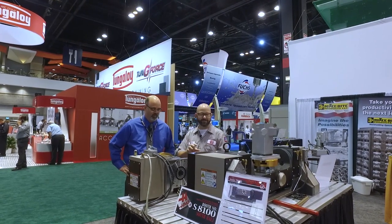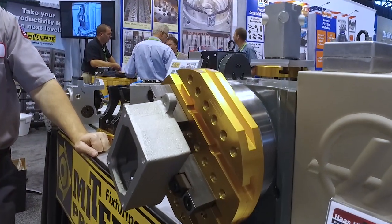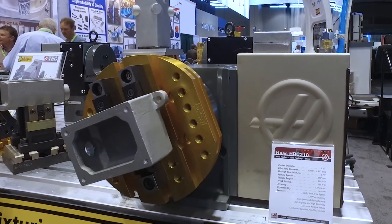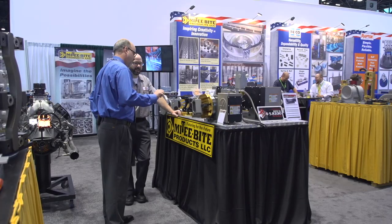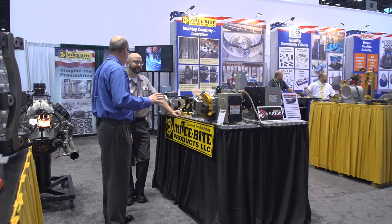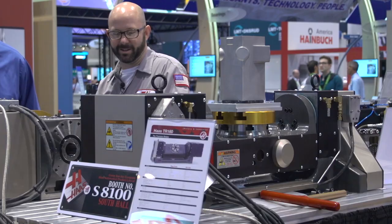Now, these I haven't seen. What's going on here? What's nice with this is it's modular and it's very low profile. This small little clamp right here produces 6,000 pounds of holding force, which is equal to most vices, and these grippers dig right in. And you've got these mounted into a T-slot, so you could slide that around? You can slide it around so it's modular, so you can accommodate any size. Oh, fantastic. What's nice is it grips real low and it pulls apart down.